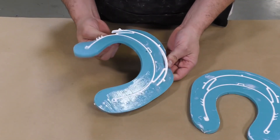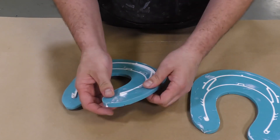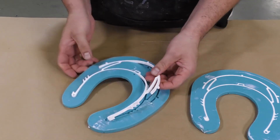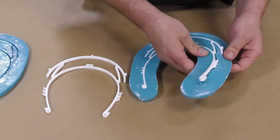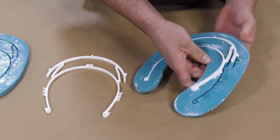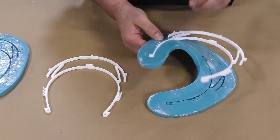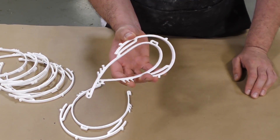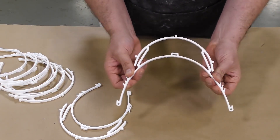The frames have fully cured and are demolded. As you can see, it's really easy to pop these out, and because we did a scrape technique when we poured the material, there isn't any flashing left to clean on these — so they're ready to be put to use basically. The material is fully cured and is quite flexible and ready to be used.